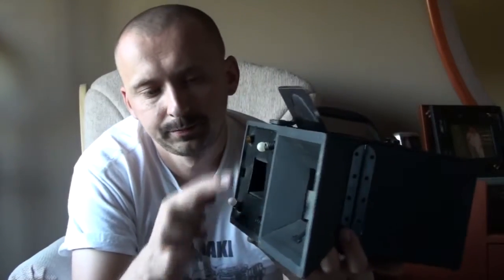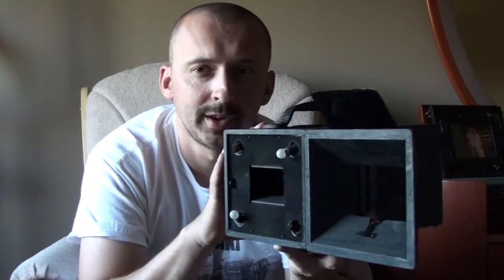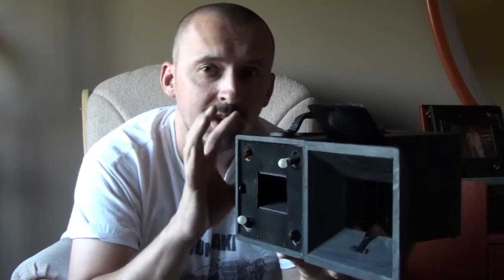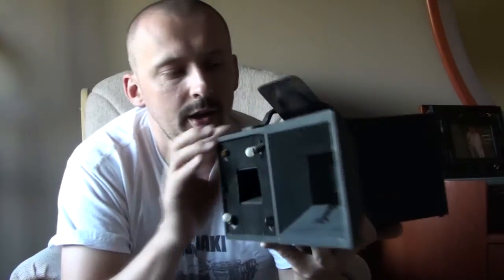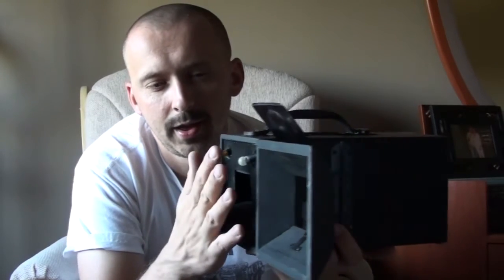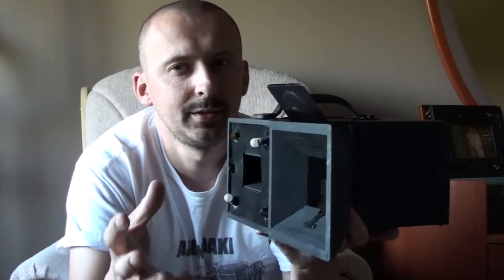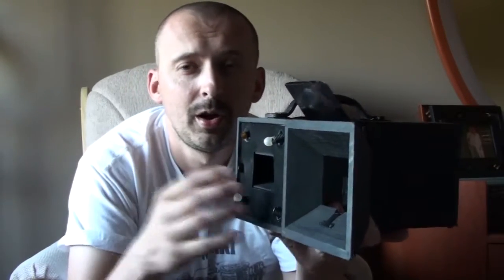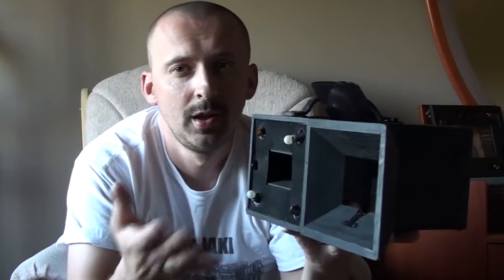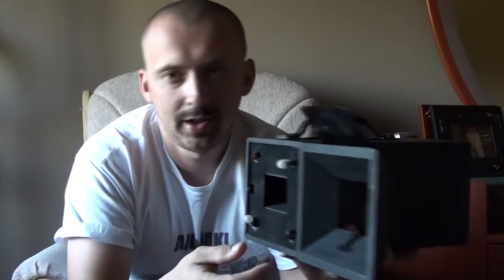The camera takes 4. And what would happen is, as you would press the shutter down, and I'll later show you how this mechanism worked, it would trigger the battery, and the electricity would pass through the light bulbs, and it would illuminate the fingerprint card or the object that you're trying to photograph, which in this case would be either a fingerprint card or a piece of document or picture that you're trying to duplicate on the other end.